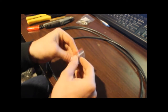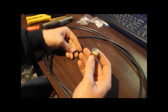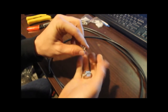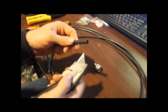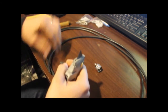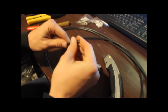We'll start with the PL259. Open the little bag — you'll notice we have our body with the threaded collar that actually screws onto the radio, and then we have our crimp collar on the back side. Start out by putting a length of shrink tubing on — it doesn't have to be exact. Thread that onto the unprepped coax, then thread the crimping collar onto the coax.